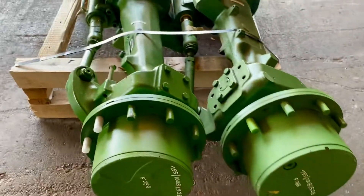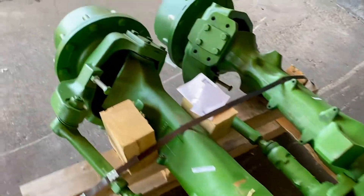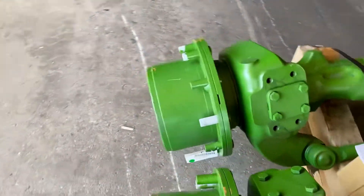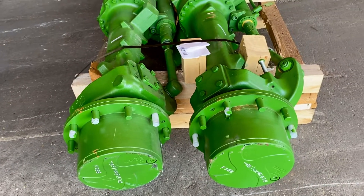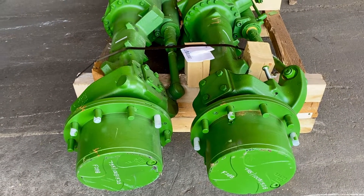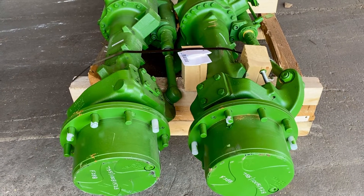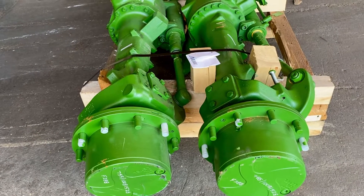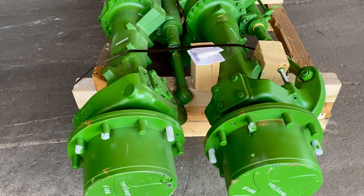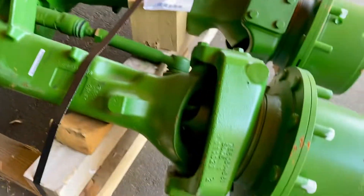We make conversions with these that will go all the way back — you could put this under a 7200. We can do 10 series, 100 series, 10 series, 20 series, even 30 series, 30 series premium. So if you're running a heavy loader and lifting round bales and you keep busting your kingpins out, these are good options.